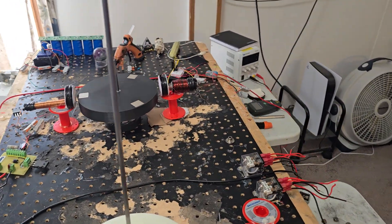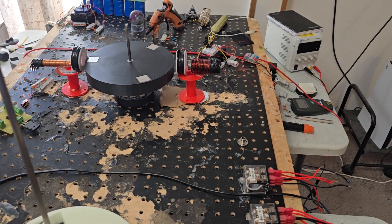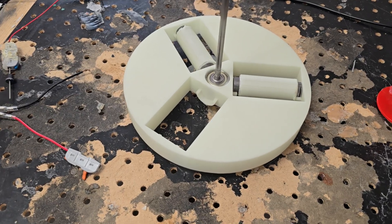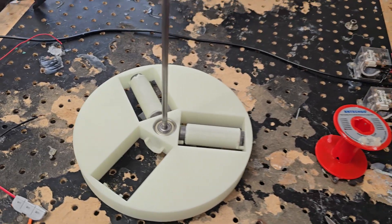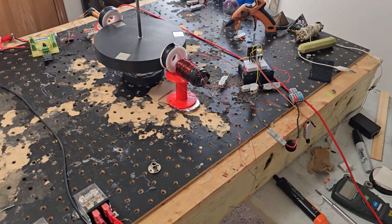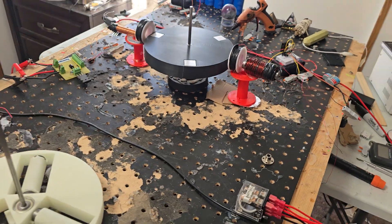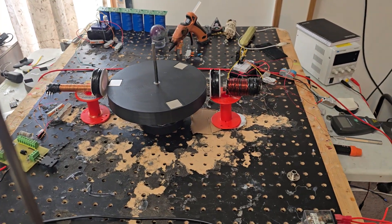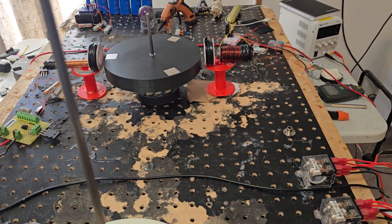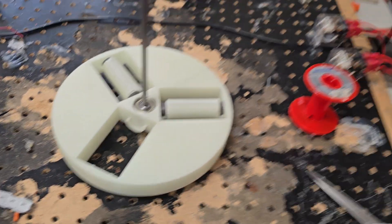So I'm going to remove it from the coil holder, spool, winder — whatever you want to call that red thing — and put it right in that empty slot. It should slide right in and it's going to be powerful, because this one is working with almost an inch and a half air gap if you look at it from the side. Here it's not going to have so much air gap, and it's going to work better.